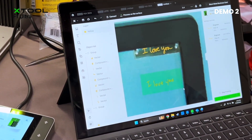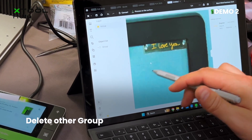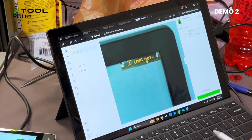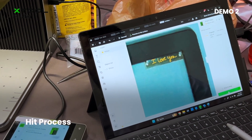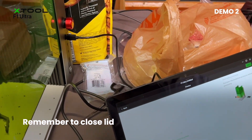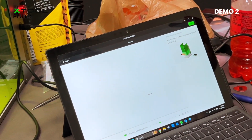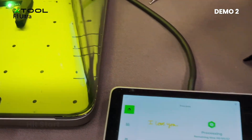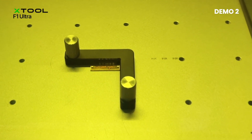In this case, I'm going to get the other group out of the way so that it's not part of an engraved section. Now if we had different pieces we could do multiples at a time, but we're just doing one pendant, so we're going to do it this way. I'm going to hit process because I'm happy with where it is. Close the lid as it's told me here — always need a good reminder to be safe. According to the software, it's going to take us eight seconds to accomplish this. I'm going to hit start, it's going to send it to the machine, and we're going to do our final approval by pushing this green button. That's done.